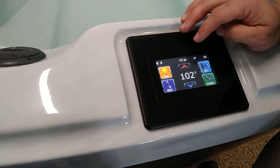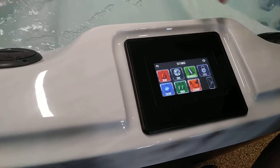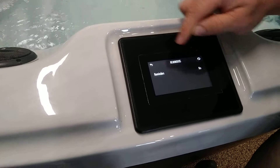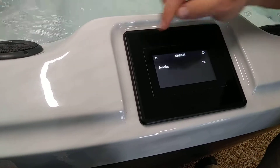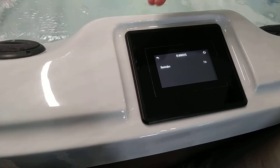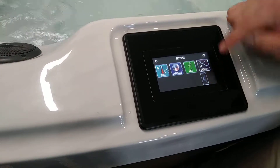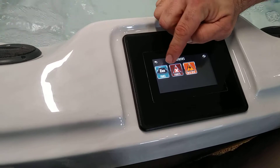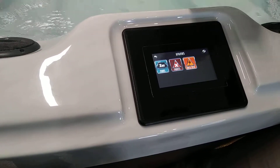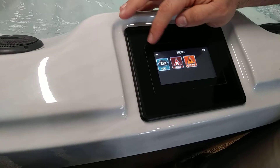Click right back and it's operational again. Here at Spa Kingdom we try to make things as easy as possible for you. There's a little button called a reminder — you can set the reminders on and off, and once a month it'll remind you to trip your breaker using the utility function right over here. What you want to do once a month is test your GFCI. Just click that button and it'll trip your breaker to make sure that everything is operational and working properly.